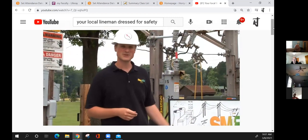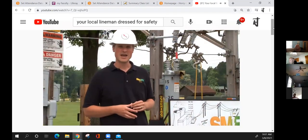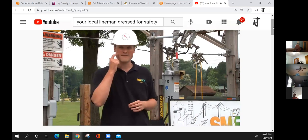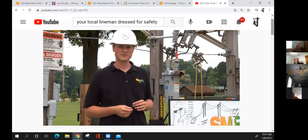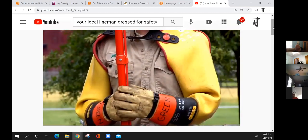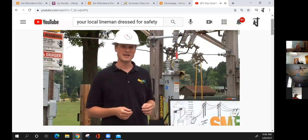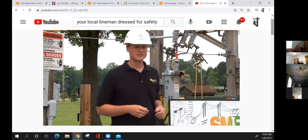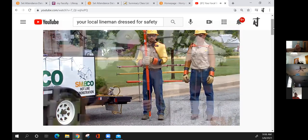They wear thick rubber insulating material — rubber gloves and sleeves — with an insulating value of up to 17,000 volts. Every 55 days, the company collects every person's rubber goods, ships them to an outside laboratory, and has them tested at 20,000 volts to ensure protection is available. Every morning, linemen do a blow-up test to check for even the slightest pinhole in the rubber glove or sleeve, because that pinhole can allow electricity to track through.